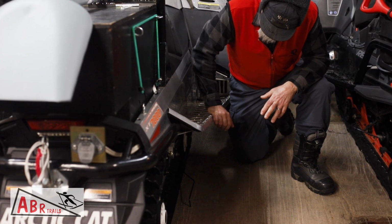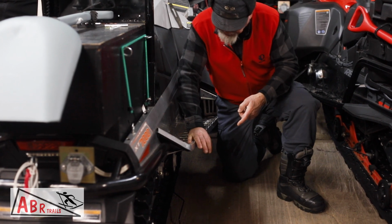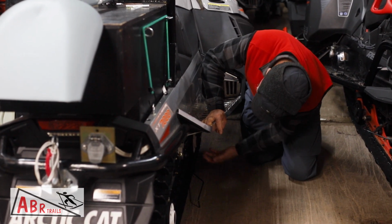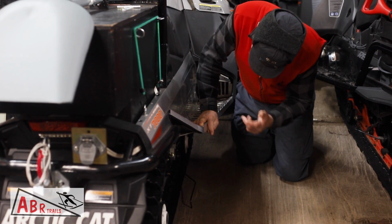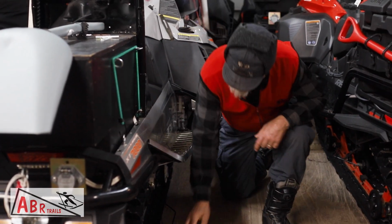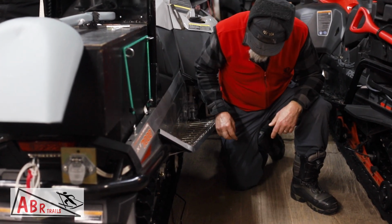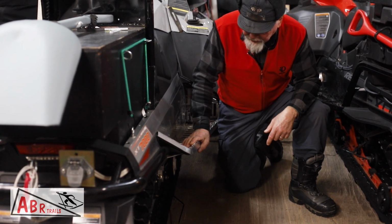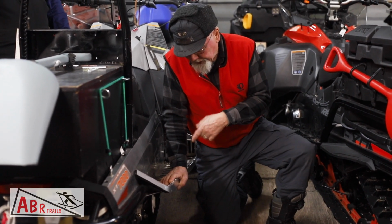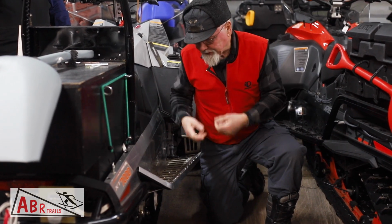The reason we have to have those is all current snowmobiles that I'm aware of use a slide rail suspension where the track is actually supported by a plastic strip on your aluminum extrusion. You got a bunch of wheels in there, but they're just a supplement. They're not enough. That plastic strip requires lubrication as it runs over the steel clips in the rubber track. That lubrication comes from snow and ice flying in there. Well, in our case especially, when we're running on a hard packed groomed trail, you don't have any snow and ice flying around. And plus, we're running slower than the average trail rider. So once again, the stuff isn't flying around.